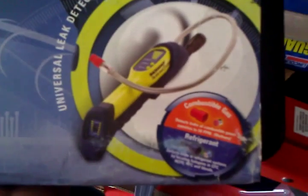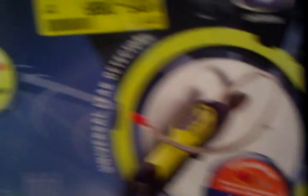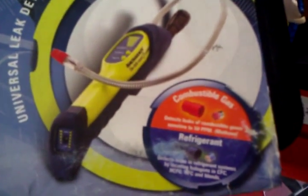I also got my oxyacetylene system. And I also got my leak detector right here — I actually had to use this yesterday because I went on a service call for a gas smell in a restaurant in the Bronx. Turns out the gas valve, which was a smart valve — electronic — after the unit was shut down it would stay stuck open a little bit so the gas would be leaking out of the burners. Within less than 10 minutes using this thing I found the leak right away. Love this tool. It's the Bacharach Informant 2. I like this one because it not only does combustible gas but also does refrigerant too. It's a great tool to have if you guys are looking in the market for a leak detector.